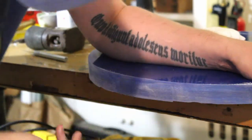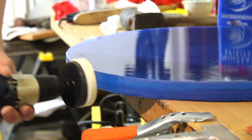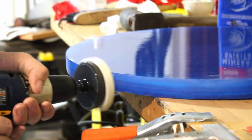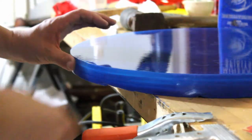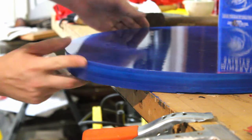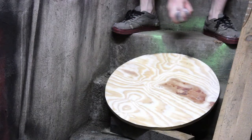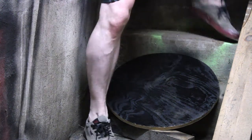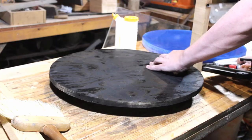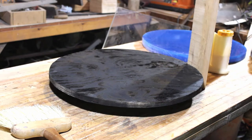Doing a little sanding — oh hi Gus, that's my kitty. Mineral spirits and sandpaper on the first bit; I went up to about 800 grit, then used a headlight polishing kit for the second part, and it worked pretty okay. I cut that piece of plywood I used for the jig into the base for the seat because I didn't want the epoxy to be see-through to the legs — I wanted something to hide the bottom.